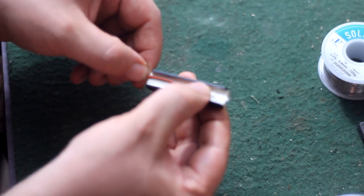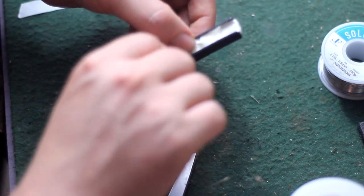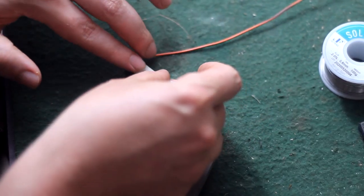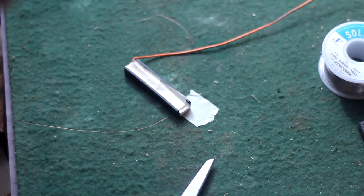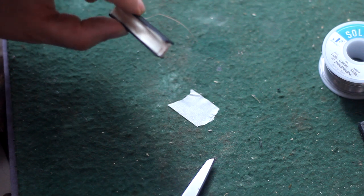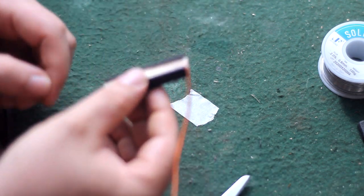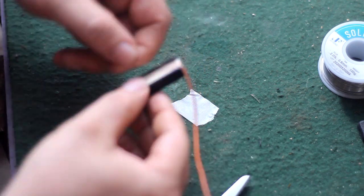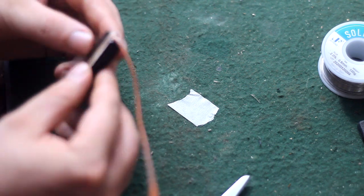So we'll take some tape, cut a little strip, wrap it around there, put the lead on it, do a couple of winds by hand, and then we can tape over the lead. And those first 20, 25 winds or so, and then I'll run the lead out the side here so that it can be securely fastened during the real winding. It's not flopping everywhere. Then I'll continue with quite a bit more hand winding. I mean, you could put it on the winder now, just start winding it up, but I really like to do the first 7,500 by hand. Watch it, look at it, make sure I'm getting everything on there secure and packed down.